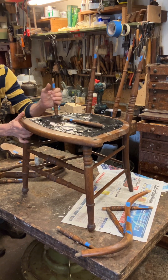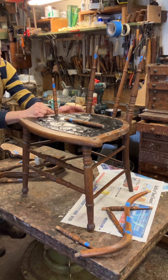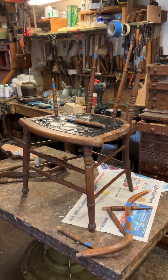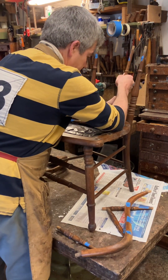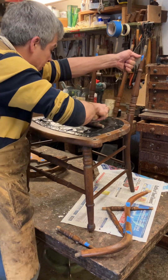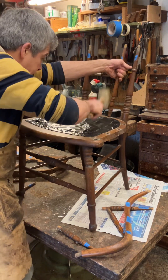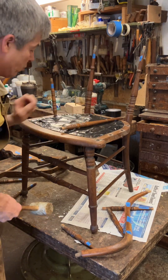I think that one's probably stuck too hard. If you really wanted to get it out, what you can do is put methylated spirits down between the tenon and that will break the glue joint. But to be honest I think that's good enough - we've got most of them out. That back one will come out because you can see it's warping already, so you might as well do that while we're at it. Just take that off - that wasn't that hard to get out, so that was worth taking out.